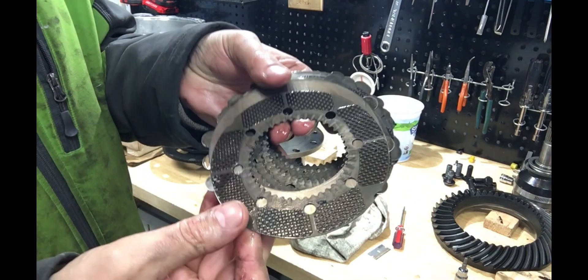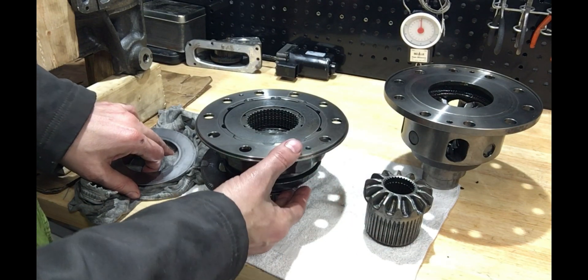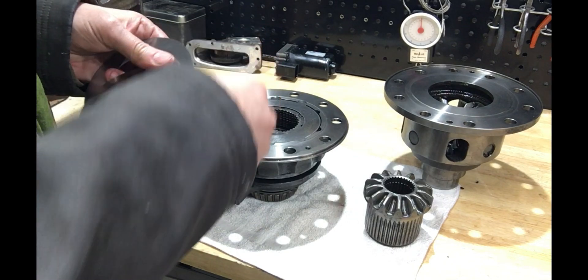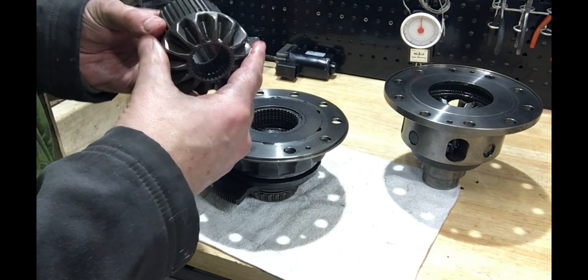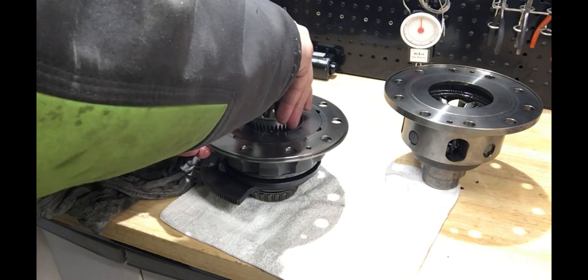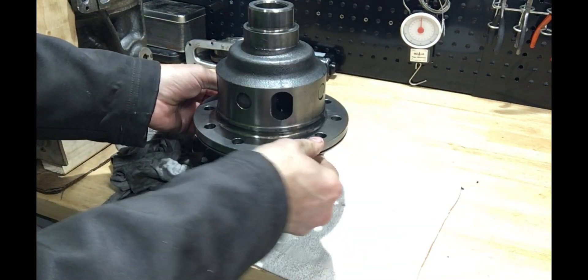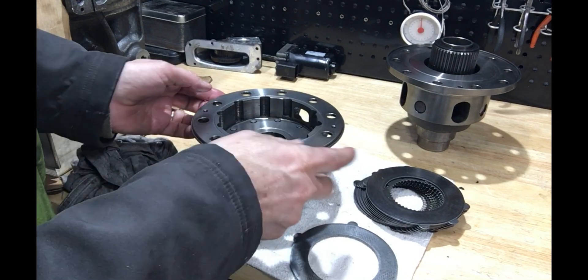To reassemble this unit, we just put the top hat upside down, load it full of the friction and stationary rings. The final stationary ring on top also gets the two spacer discs. We take the axle gear out of the lower unit, make sure the oil rings are in place, and make sure we can engage all the clutch discs. The stack-up is complete — this goes on, put the two screws in, and that assembly is together. I'll take these dimensions, record them, and see if we can get replacements for these.